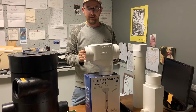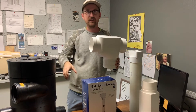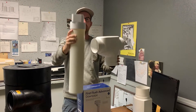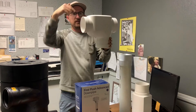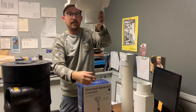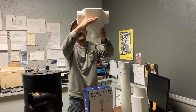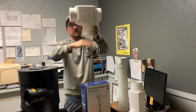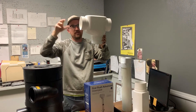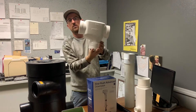We also have a first flush filter kit. The basic principle is that instead of routing your downspout directly into the cistern, you route it through this T-assembly. The downspout comes in here, you transition it to pipe with an adapter, put an elbow in, and your downspout runs in. There's a standpipe — just a section of pipe that goes down with a drain on the bottom. The water goes in, fills this standpipe during the rain event, and then the clean water continues into the cistern. The idea is that the dirtiest water comes off the roof initially with the highest sediment concentration, so you're directing that first water into this standpipe instead of directly into the cistern.